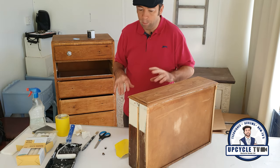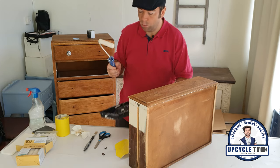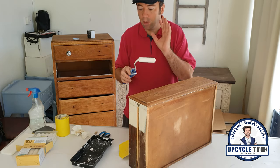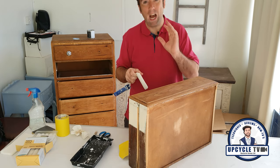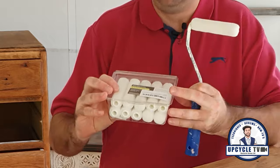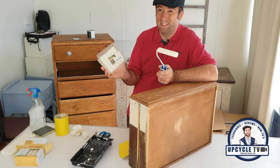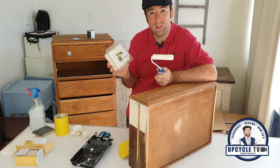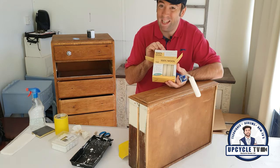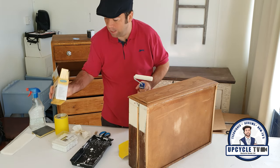As I said, I'm using the Vintage with Grace chalk paint, but there are two key factors here. Firstly, we're going to use a mini roller — the reason I use a mini roller is because when you're working on furniture it's a nice size and it covers it nicely. A lot of people say use foam rollers. They are okay, but they're not as good as these. This is a Hamilton Prestige felt sleeve — they're absolutely fantastic. I'll leave a link in the description. I've also got these 100% wool ones which are supposed to be even better than the felt finish, so if we get time in this video I can have a go and see if they make any difference.